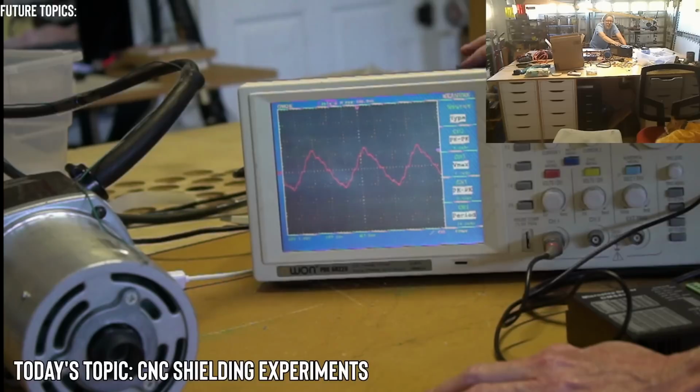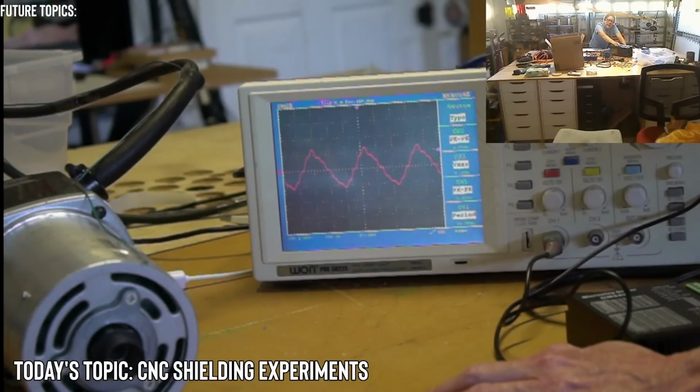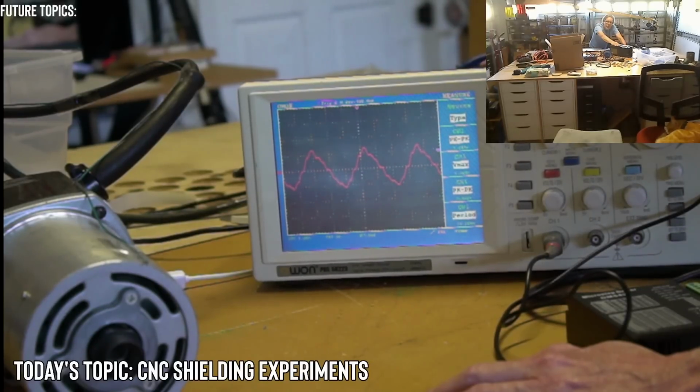An axial load would be a really nice test for a ball screw. With an axial load, you're also going to find out how much load you'd have on the transversal axes, because the balls are round and the grooves in the screw are round. So you would see any deflection in that respect as well.